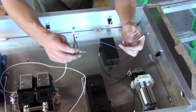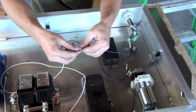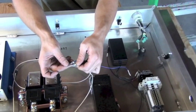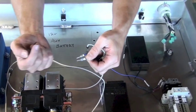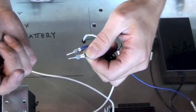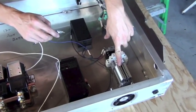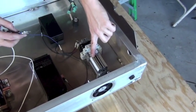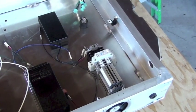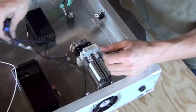Taking a close look at the termination points of each wire connection, you'll see a numerical designation. These numbers match the points where they connect inside the high voltage control enclosure. Here we're looking at connections for terminations 9 and 10. These connect into the DIN rail, with connections 19 and 20 on the opposite side, which continue to other parts of the vehicle. The numbers are on both the wire itself and on the connection point in the system.